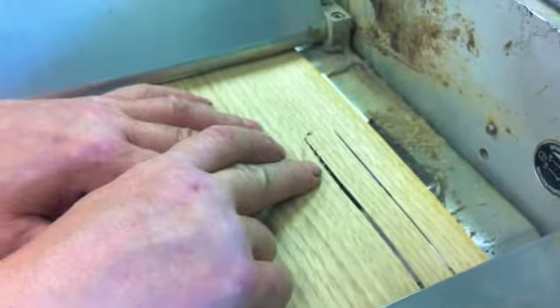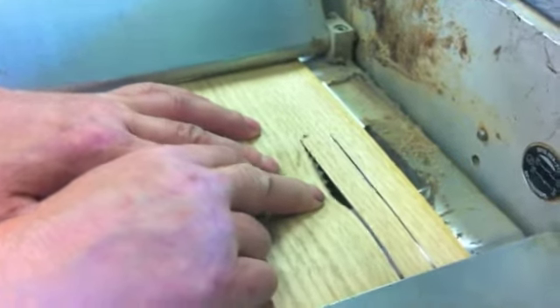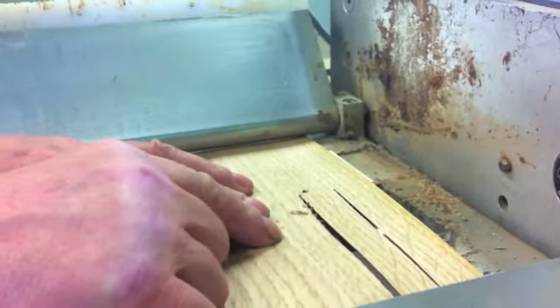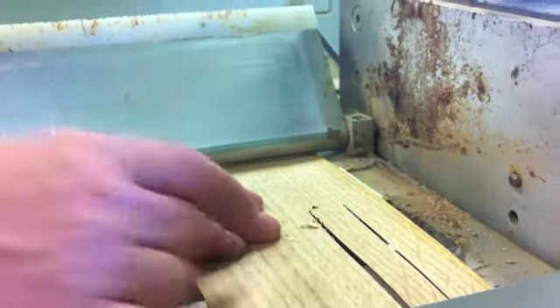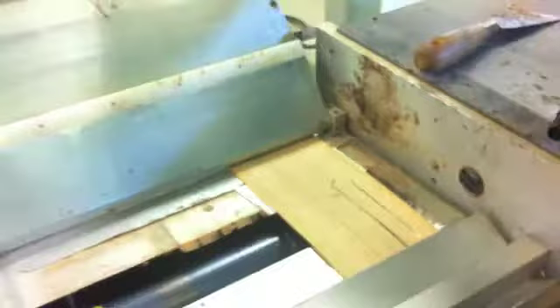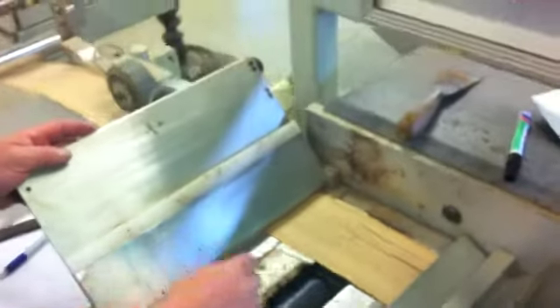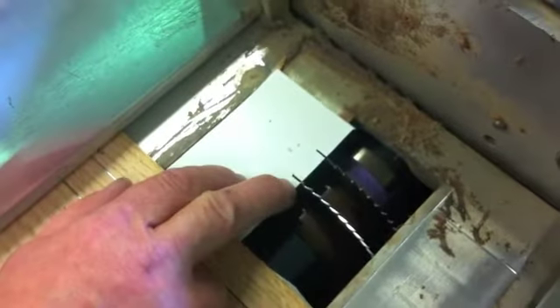The saws are turning against the direction of the veneer. Very important is the height of the teeth — the veneer must not be lower than the teeth. Not too high, but around 2–3 mm lower. The teeth are 5 mm, so don't lower it more than 5 mm. This plastic you only need to remove after a few months. But every time you change the width, or if you go too close to the teeth, you need to change that plastic. If you go in the middle it will hold, but if you go to the side, it will break. It's very important that this stays clean.